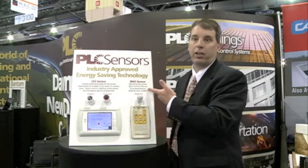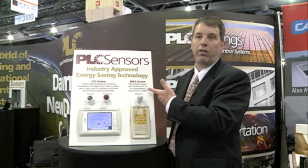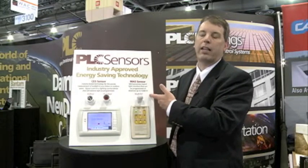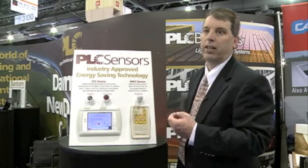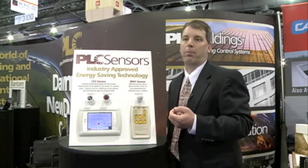The MAS sensor is based on a current output — 4 to 20 milliamps. This is ideal for integration with HVAC systems or building automation equipment that typically takes a 4 to 20 milliamp input.